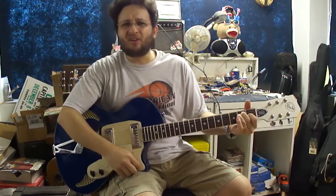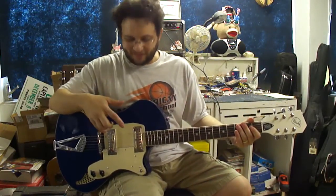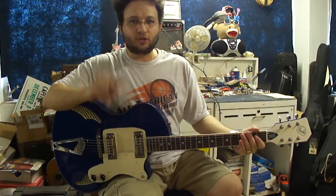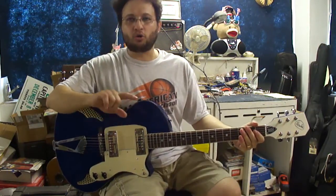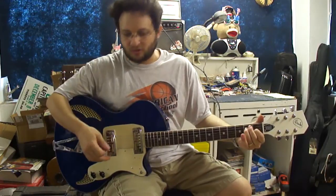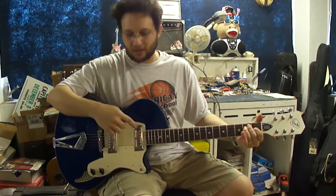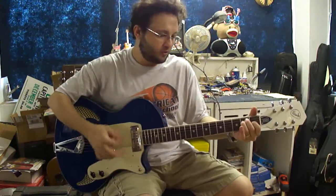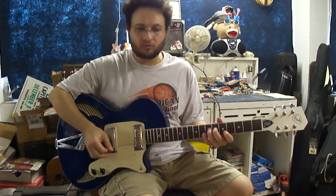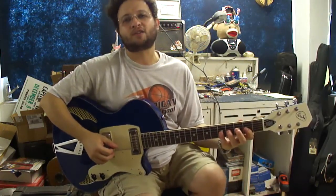In the middle position, even though they're both wired correctly — and they were only two-conductor without a choice of orientation — they're out of phase. There was no way for me to counter that without opening the pickups themselves and potentially damaging them, so I wired it as so. It's not bad sounding — it sounds like the old Telecaster type wiring.